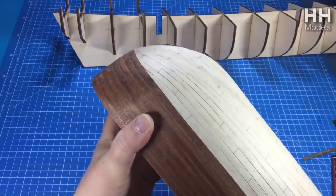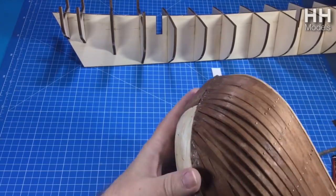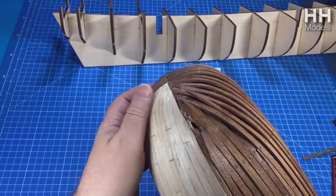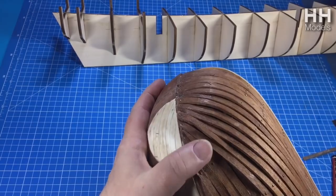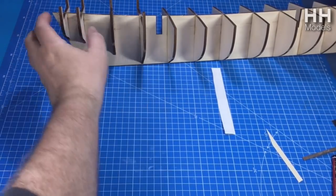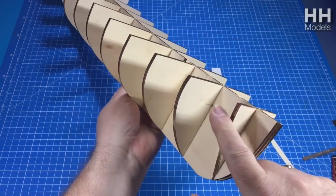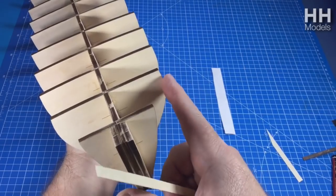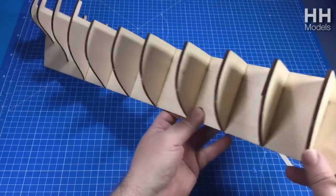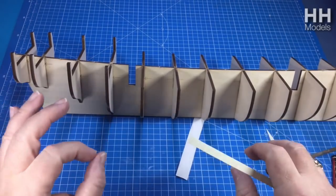With this bounty I broke one other rule: you should plank in pairs — always plank one side then the other. But I was repairing this and doing it to illustrate for the video, so I broke that rule. Normally if we have a clean hull, we would plank one or two planks on that side, one or two planks on the other side, and then move down one or two.